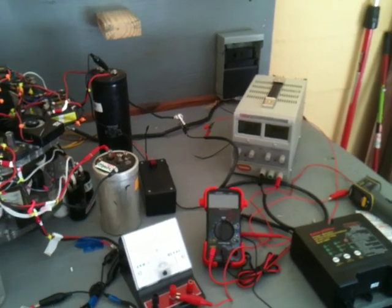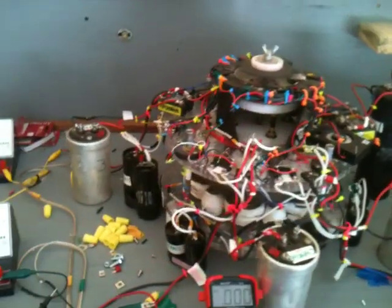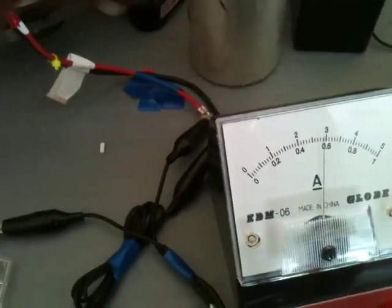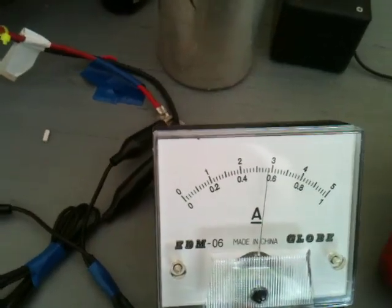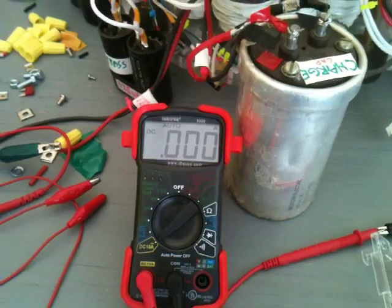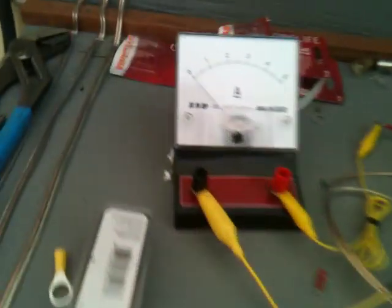Here we're showing the DK alternator power hub. Right now we're putting in a little bit over 24 volts and about 0.5 amps — we're actually drawing about that as shown on this shunt meter. We have the input power from a DC power source feeding in, and then we have our external charging system set up, which is pulsing out about 300 milliamps in a pulse discharge. We're putting out about the same — probably 400 — and on the back EMF circuit, slightly higher.